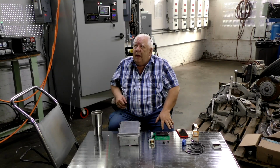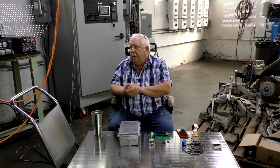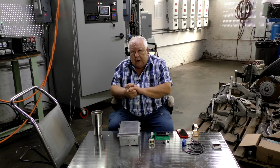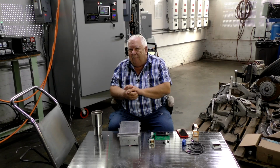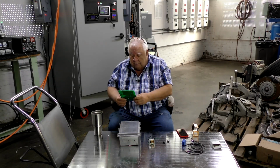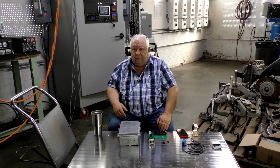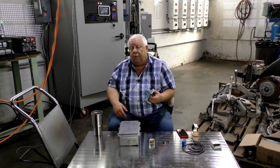I would warn you that the ability to measure is the ability to become confused at some level of accuracy. You understand that your Fluke meter, a lot of these things massively average their readings before presenting them to you so you don't go blind. I'm not going to bother with that. We can sort all that out in software. We want it as quickly as we can get it, and as accurate as possible. There's a lot of variations in your power line. You'll be surprised to learn voltage isn't precisely voltage, and current isn't precisely current if you have the ability to read it at a certain resolution.